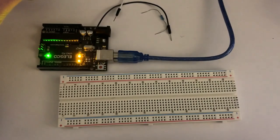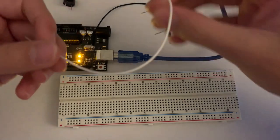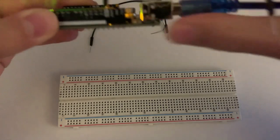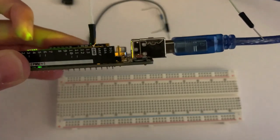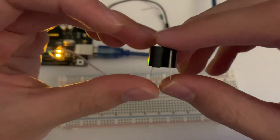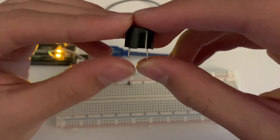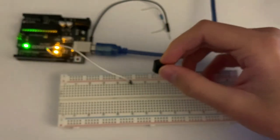So now let's focus back. Let's start off with our first wire and we're going to connect this to the ground GND. This should be all relatively familiar — it's quite similar to the LED. So we're going to take GND, and remember, take our buzzer and remember the short side and the longer side. The short side is going to be in alignment with the first wire.